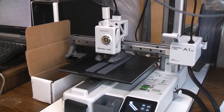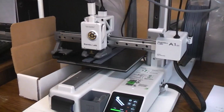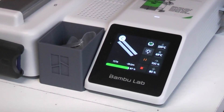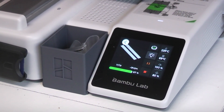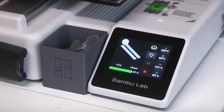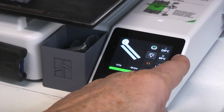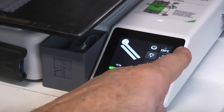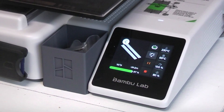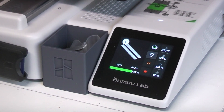You can see it's moving right along printing the two treads. We're sitting at 97% done with two minutes to go. The bed temperature shows 69°C and the hot end at 230°C. I'm running at 100% speed — I could go faster or slower — and the fan is running at 80%.